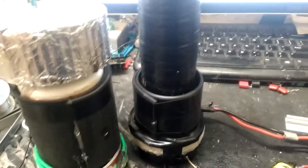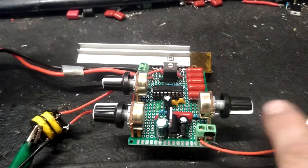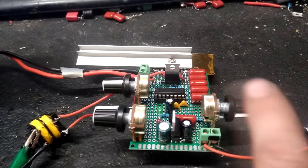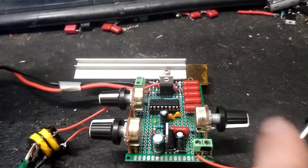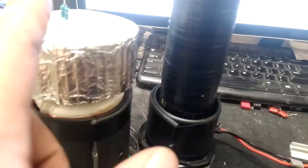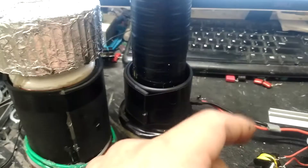I'm actually going to put this coil on this circuit. It really wanted a top load — I haven't quite figured out why, but without the top load the output gets real weird. It makes it seem like this voltage divider here is losing contact when I move the knob around. I checked the pot and it works fine, so adding that top load gives it what it needs to work better. I'm going to try to make this one dual resonant maybe.